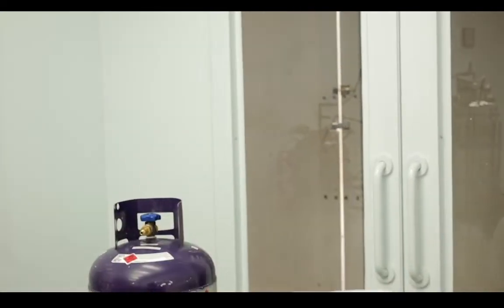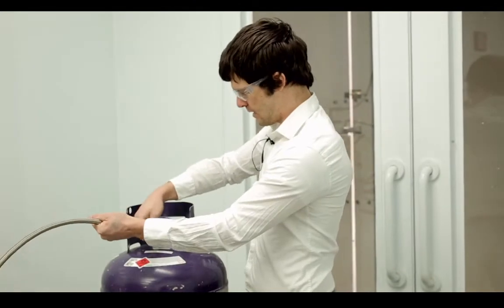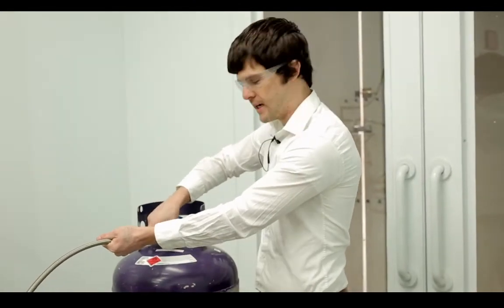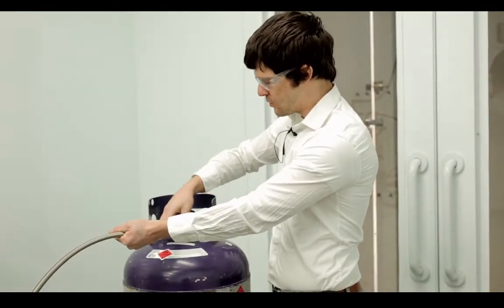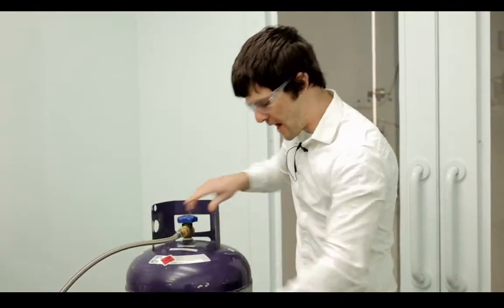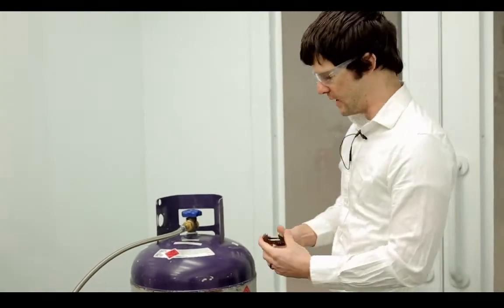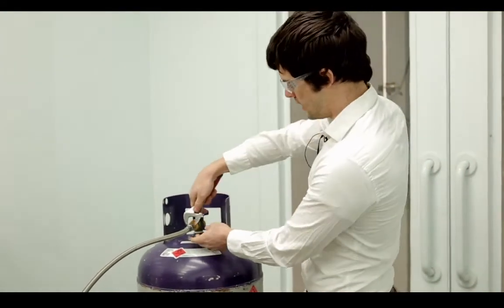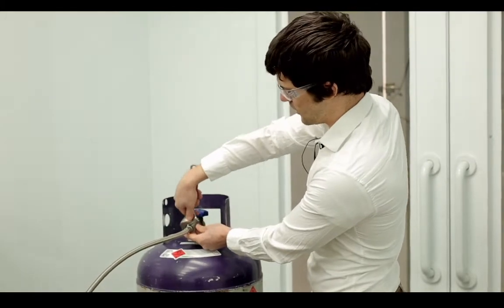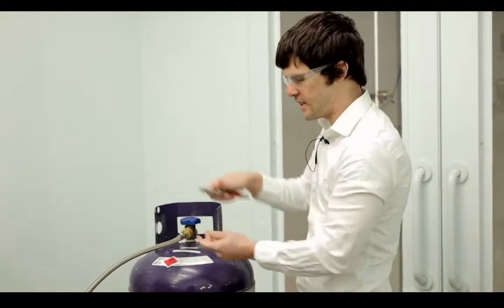Once again, this is our hose. This is a 3/8 braided gas hose, and it's rated for 300 PSI. These will be righty tighty. And once again, since it's connected to brass fittings and even our stainless steel fittings, we never want to over tighten anything. So we'll get it finger tight, and then the same concept will apply. Quarter of a turn, make sure everything snugs up very nicely.